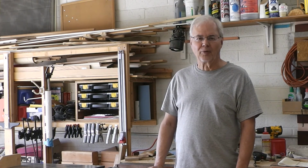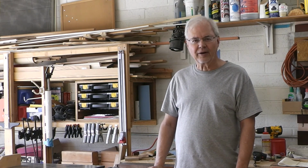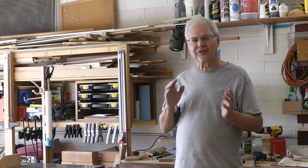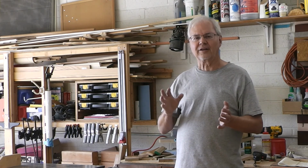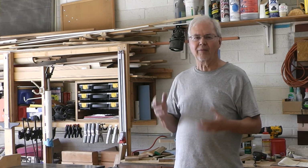They say 2 people. One working the machine, putting in the bundles, and the other one up in the attic. We found 3 would be better, because you need that one person at the edge of the attic opening to keep the hose either pulling it out, putting it in.